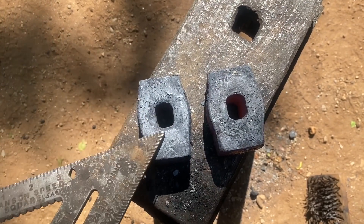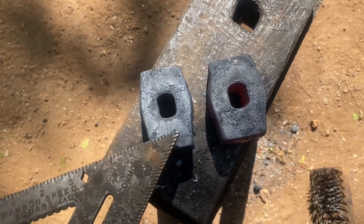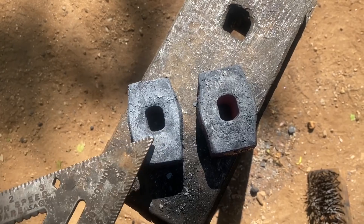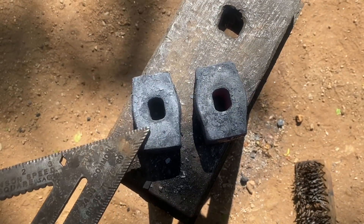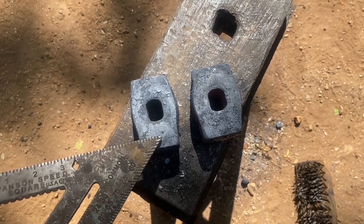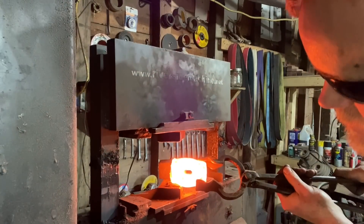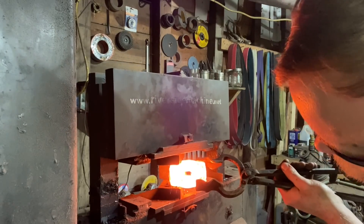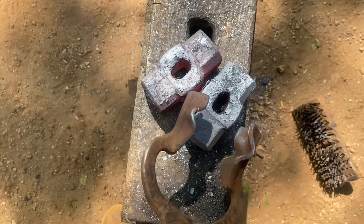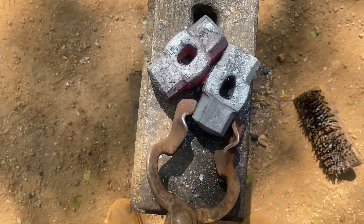This one here is a little bit out of center, but that's really not a big deal. There's about an eighth of an inch of tolerance you can work with, because the billets are cut oversized, and after you isolate the working ends, if you draw the cutting end out of whichever one has less material, there's still a good bit more there than you need. The next step is to go ahead and isolate and set down the working ends. So we're going to go back to the press using the flat dies and an inch and a half kiss block and draw the ends out to inch and a half square. Alrighty, we got the material for the working ends isolated, brought down to inch and a half square. Next thing we got to do is run the punching die back through the eye one more time from each side, just to open it up a little bit more and get ready for the drifting.